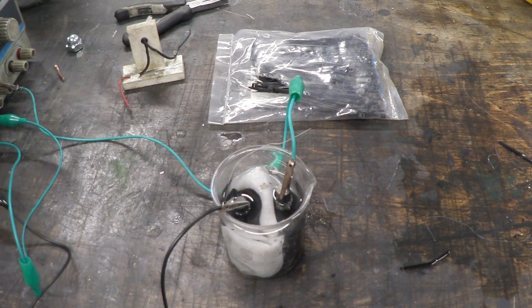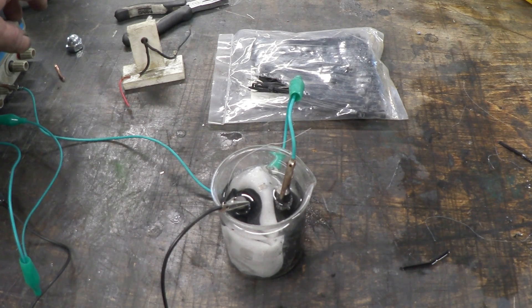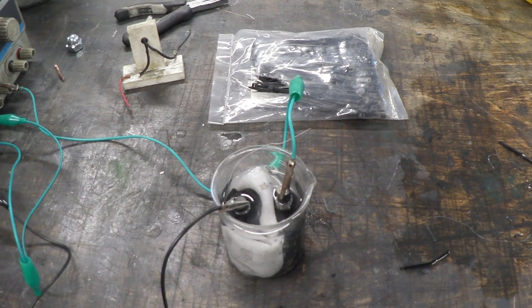I clearly don't know when to stop — I think it's something of a problem. What I've done here is taken two carbon rods, put them in the same vessel, and wrapped some carbon felt around them to create another electrolyzer cell. It should be obvious that interleaving these carbons would be far more efficient, and putting them on stainless steel would also work — you could make them to any size in a square block arrangement. If I put a bit of power on that, we can see hydrogen bubbling off on the negative side beautifully, producing lots and lots of hydrogen.